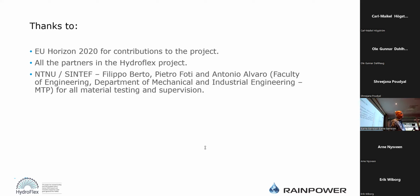And also because we are not able to measure directly in the highest stress amplitudes, we need to extrapolate. And for that, we need the accurate model. The shapes of the welding and the radius and all this can affect the stresses very much. So you need the accurate geometry of the unit, and all units are different. So you need to do it specifically from unit to unit.